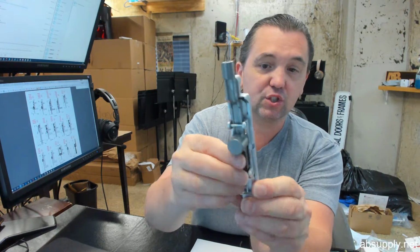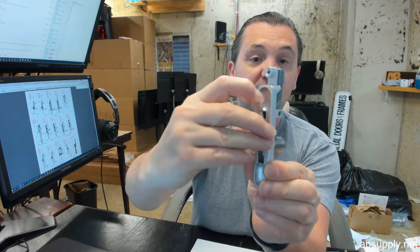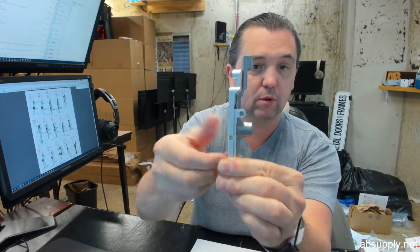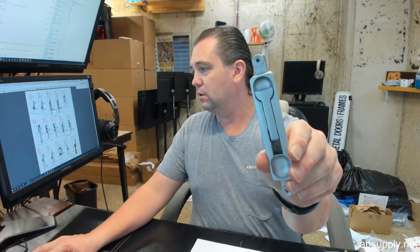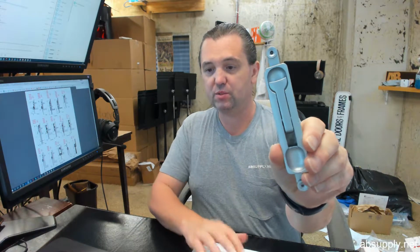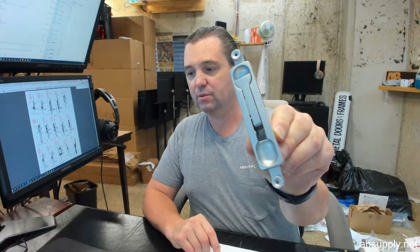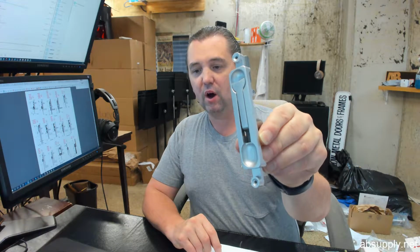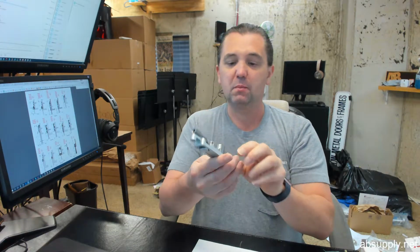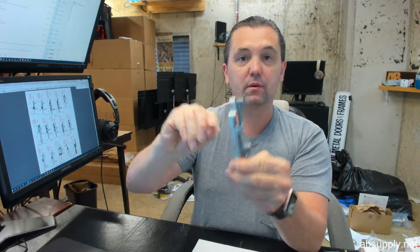This is shown in the thrown, locked position, or retracted position, in the aluminum color. This is a mortise bolt used on commercial storefront and architectural aluminum narrow style doors, made for easy installation. It replaces most brands of storefront flush bolts. It has an automatic spring-loaded lever action, meaning a spring governs this so that you get a very positive locking up and down.